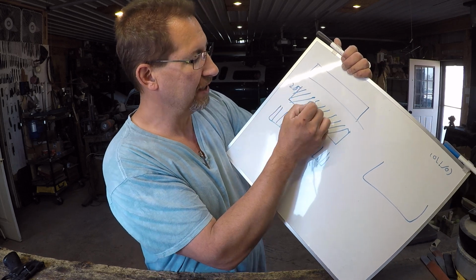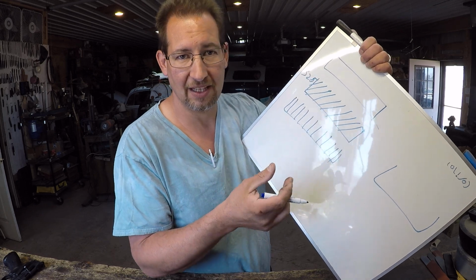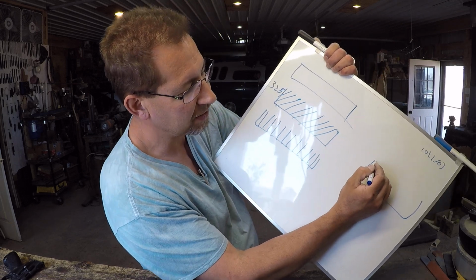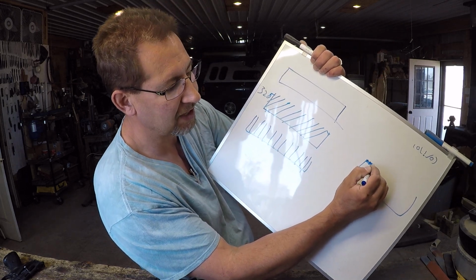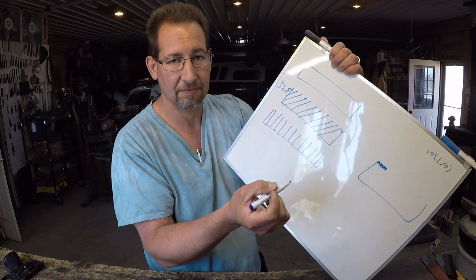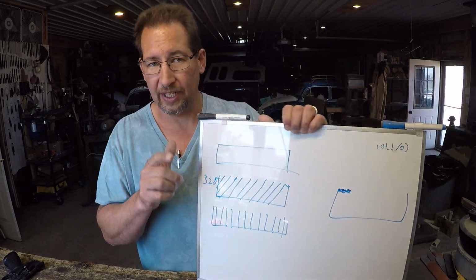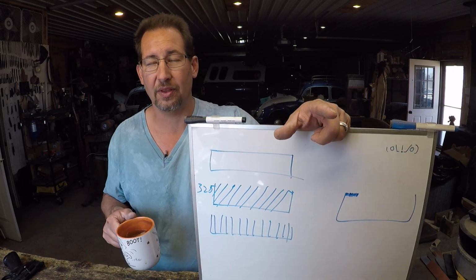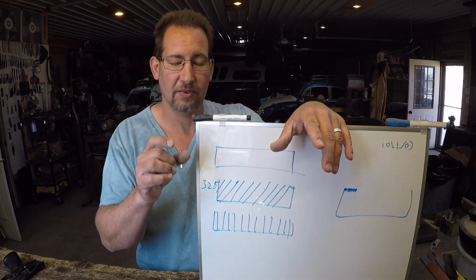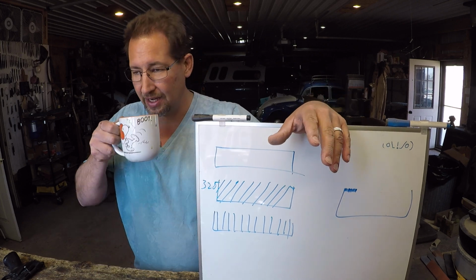So if this is 325 of these teeth in one edge, chromium oxide paste I think is like 30,000 grit, okay? That means that each one of those teeth would be fine enough that I'm not going to be able to make that fine a mark with the marker, all right? Now, 325 grit teeth per inch, or 12,000 or 30,000 teeth per inch, or grit, okay, is really awesome for straight razors where all you're doing is cutting hair.